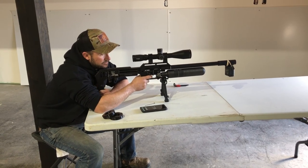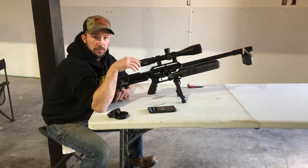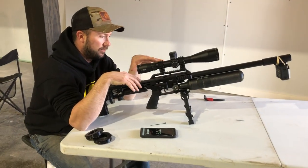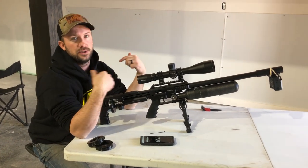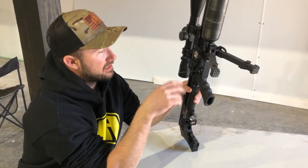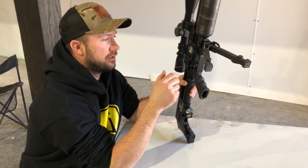Fire it again. We've actually lost a little bit, which is common when the hammer's hitting a little bit too hard for the reg pressure. So the next thing to do is take up the reg pressure. We've got our allen key fitted — we're going to go counterclockwise to raise the pressure a little bit. We're going to watch the pressure gauge here.